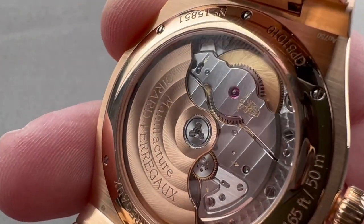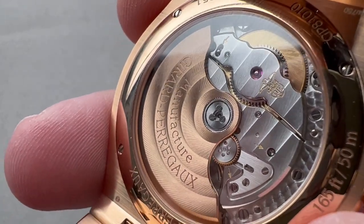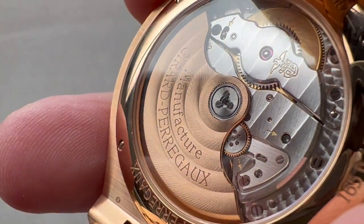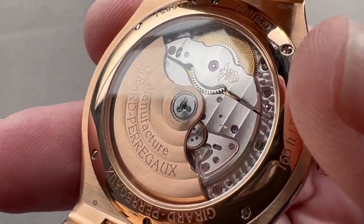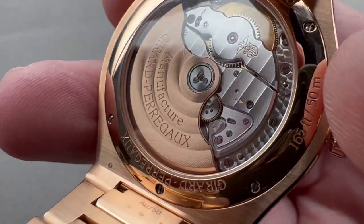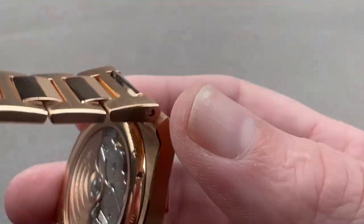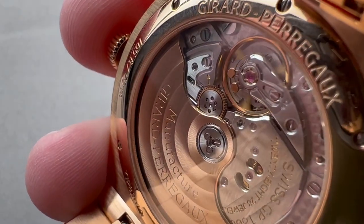The architecture of the movement is handsome. There's a large symmetrical bridge for the mainspring barrel; the ratchet wheel is black polished, and then the barrel beneath has a solarization. We have multiple different finishes on the rotor at center. The rotor is beautifully beveled on its edge, with circular Côtes de Genève all the way around, and then linear Côtes de Genève on the bridges themselves with engine turning on the outer lips of the bridges. Locating pins used to help place the bridges on the base plate have been polished on their heads — very similar to what Patek Philippe does. We also have black polished screw heads with chamfered slots, and circumferential satination on the wheels, including the reduction wheel for the winding system.